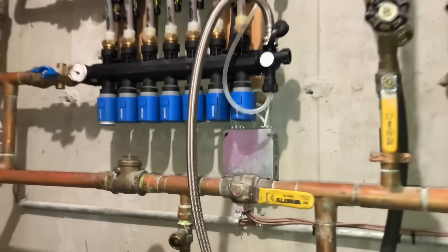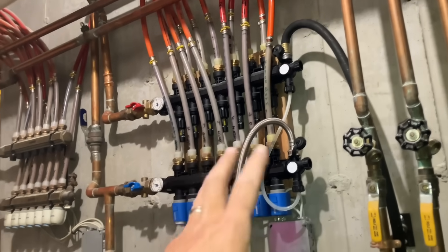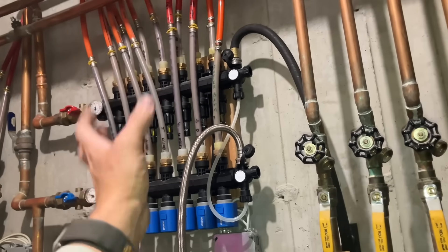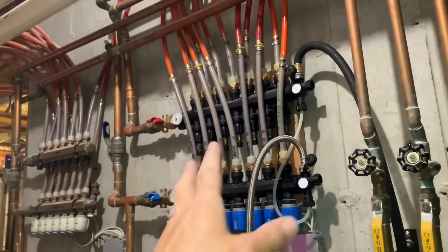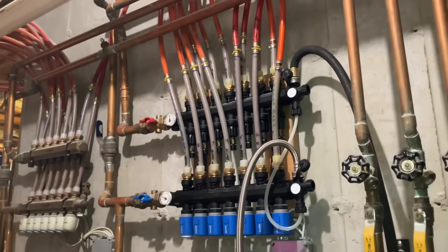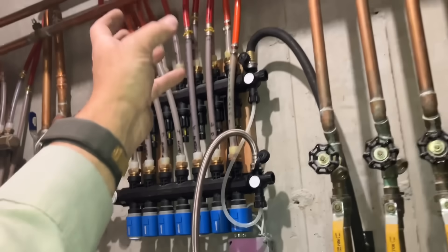One of the things you have to be very careful with here is we don't want to cross-contaminate the water. I have domestic potable water directly connected to hydronic heating water. If there is a pressure loss on the domestic side and those valves are open at the faucet, we risk introducing filthy and potentially dangerous water from the heating side into our domestic potable water. So be very careful — install a check valve or backflow prevention device in line between the hose faucet you're connected to and the domestic potable water.